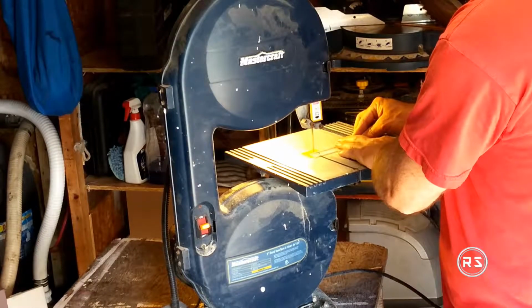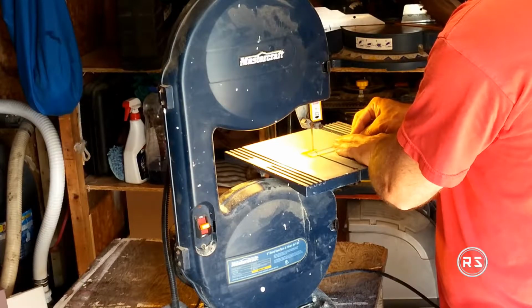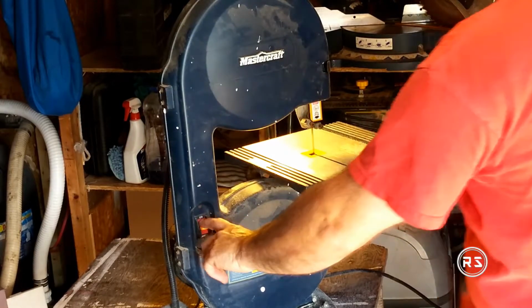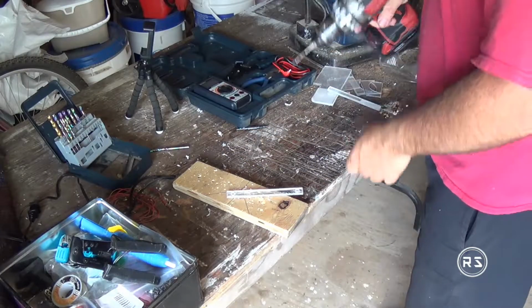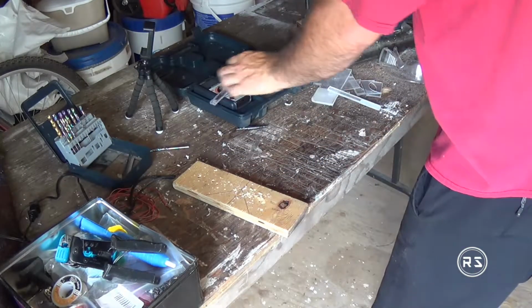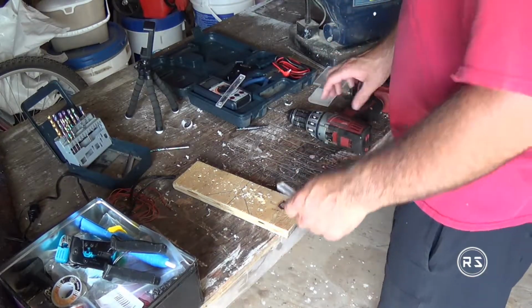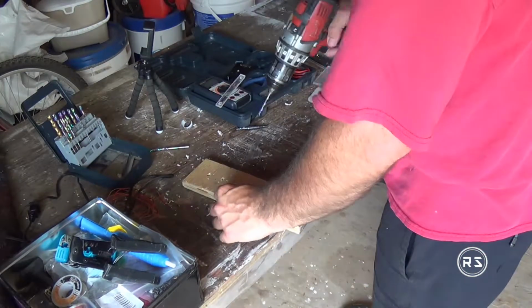And this arm is simply two pieces of acrylic sheet of 1/8 of an inch to create a strong 1/4 of an inch thick by 1 inch wide arm, which will be big enough to support the stress and the pressure caused by hard driving of an F1 simulation.